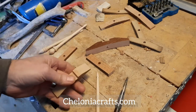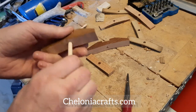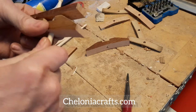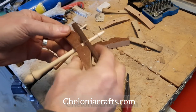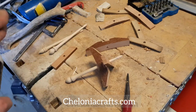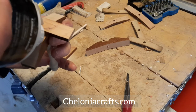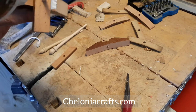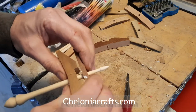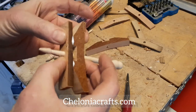Next it's back to the bench to start gluing on the top pieces of the spindles. At this stage I'm only widening out the spindle holes just enough so that they will be a tight fit quite high on the spindle shaft, which I'm using to align the two pieces. Again, accuracy is the key here for good balance later. On this occasion I'm using standard off-the-shelf PVA wood glue, which works very well, but I do on occasion make my own wood glue out of natural materials. If that's something you find interesting, then why not visit the website, drop me a message, and let's talk about making you a bespoke spindle that's fully environmentally conscious.